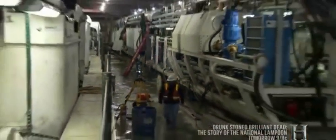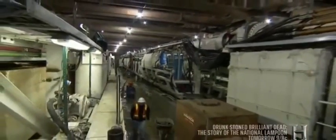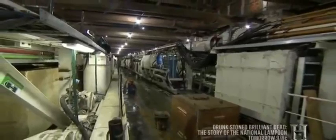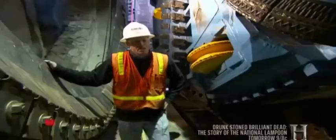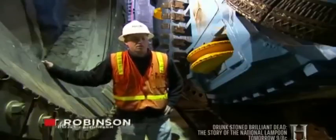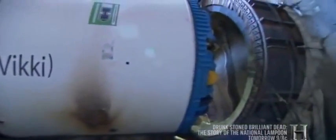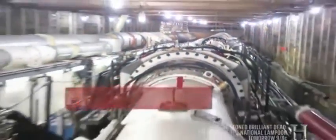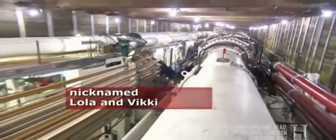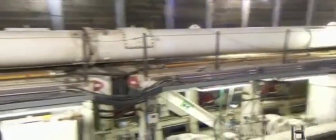Today, tunnel boring machines, or TBMs, are standard issue in civil engineering tunneling projects, like this extension of the Los Angeles light rail system. This tunnel stretch is a 7,000-foot long stretch underneath Boyle Heights. Twin tunnels, 6.5 meter in diameter, 21 feet diameter. 65 feet underground, the tool of choice, or rather tools of choice, are twin tunnel boring machines. The 344-foot long, 1,025-ton beasts are expected to burrow through 50 feet of earth per day.